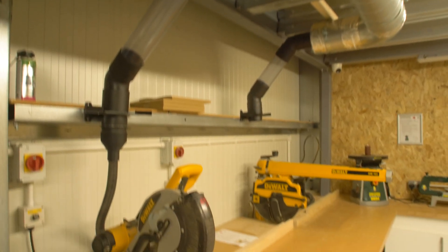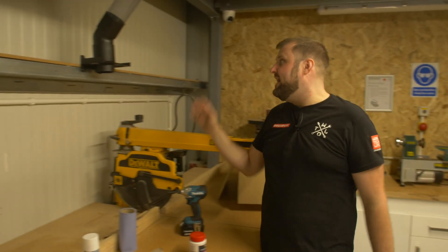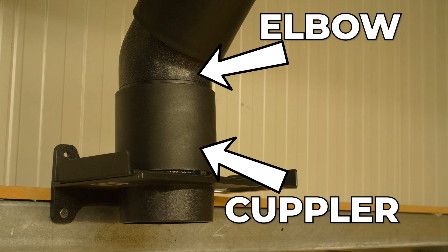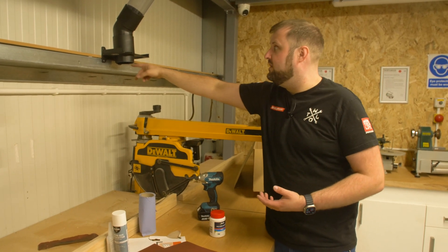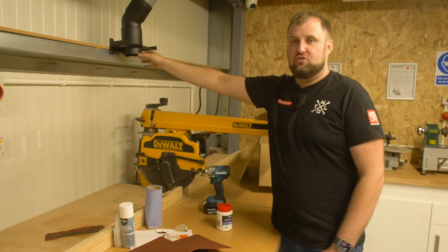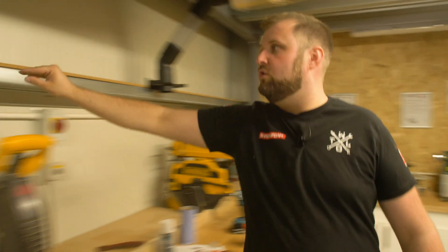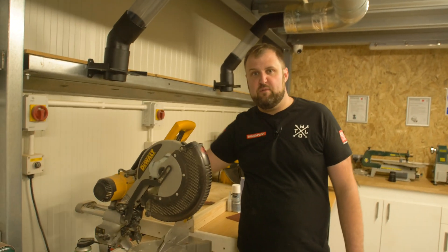We've finally finished all of the final legs. Every single leg off the system now has a blast gate at the end of it — it's a sealed system. What I've just been doing is gluing the last connection with some solvent glue: Bostik PVC pipe adhesive from B&Q. These couplers attach really snugly to the elbows, but the blast gate to coupler connection was weak and not a great fit — they seem tapered, designed for flexible pipe and a jubilee clip. So I used the solvent glue, sanded away the gloss to rough up both surfaces, then glued them together with a little clamping pressure for three or four minutes. Now they're all a lot tighter and sturdier. Every single one comes down 100mm to a blast gate above each machine, with the final leg done in flexible hose.